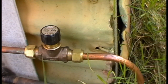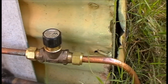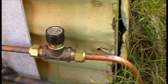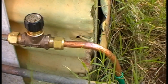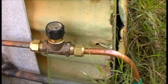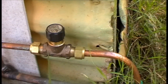What we call a duo valve. It's very important that any water that's not heated to 60 degrees Celsius is protected from flowing backwards into the drinking water supply. The duo valve comprises an isolation valve, and inside there's a check valve so that no water can flow backwards. Because the batch heater doesn't always heat to 60 degrees or higher, there's the potential for bacteria to grow in the water contained inside the 250-litre tank.